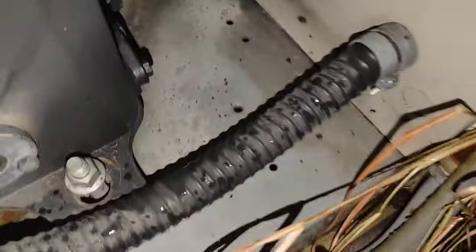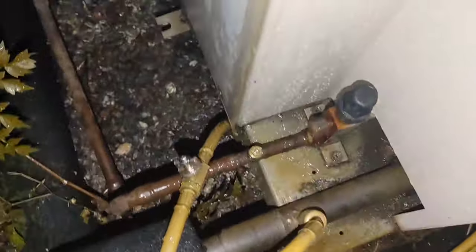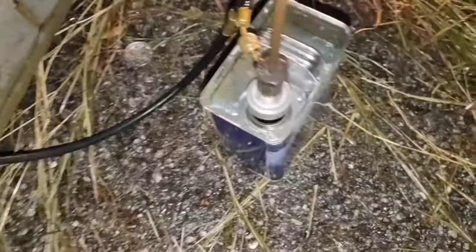It's raining inside the freezer and I'm going to try to get some refrigerant oil in here. So to summarize: we're low on oil, I had the Schrader valve leaking and got that repaired. Now I'm adding oil - I've got my oil pump and I'm going in through the suction line.